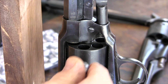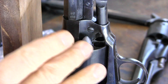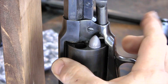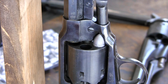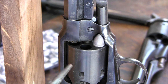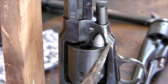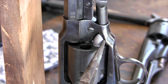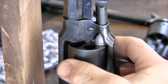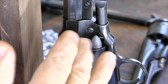With our Rogers and Spencer pistol, there is room to where you can rotate this around and get that bullet to drop down — that's what you want. On the Colt we're going to have problems, but when you rotate this around you will see you have all kinds of clearance here, but we're hitting a little bit here. This gun is close, and it has relief areas cut in instead of a sharp edge like on the Colt. What we'd have to do with this is just file that a little, remove very little material — I'd rather have it go through clean.